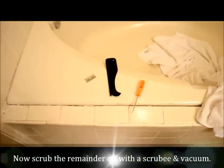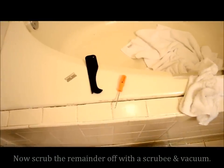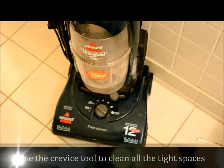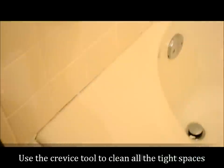Finally I'll vacuum all the dust off. I've probably got about 90% of the old caulking off the tub. I used the plastic tool I got at Home Depot, a flat razor, and a little scraping tool for the deep stuff. The next step is to use the vacuum cleaner's crevice tool to really get all the old loose grout and everything out of there before making sure it's all dry.